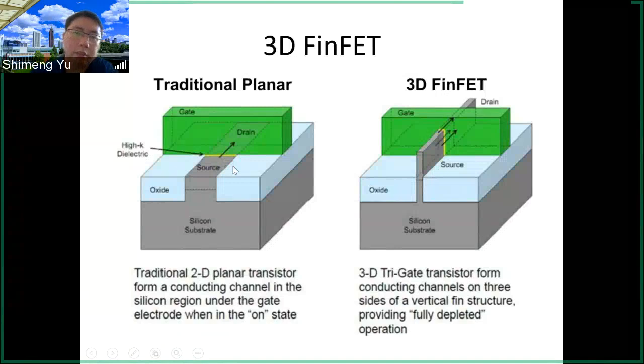Here we show the structure: this side is the source, the other side is the drain, and we have the gate here. This is the gate oxide region — there is some thickness to the oxide. The gate is covering the channel, and the oxide separates the gate and the channel. The channel is where the current flows — that is the surface of the silicon. You have a silicon substrate, and the top surface of the silicon becomes the channel when you turn on the transistor above the threshold. The current flows on the surface. This is a planar structure.